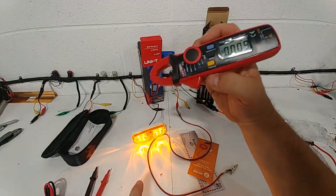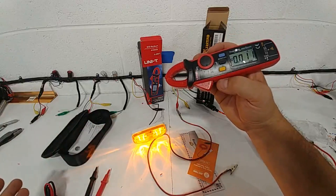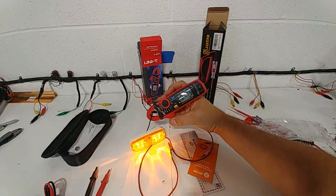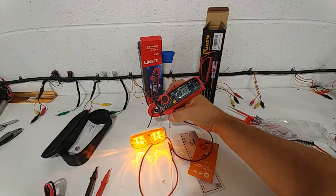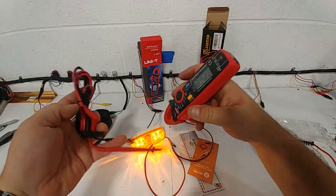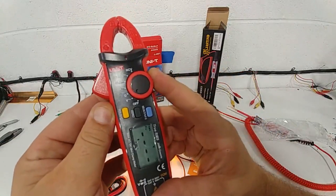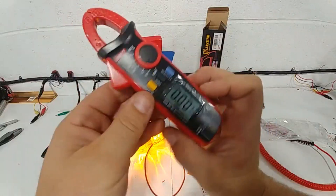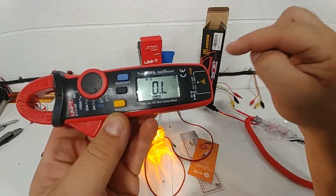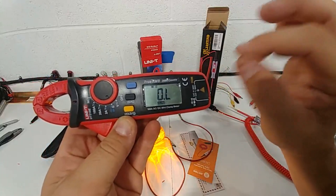Very, very useful to know what size fuse to put on your 1, 2, or 20 LEDs — what do I fuse my main wire on? Well, set your system up and check your draw. We're at 0.11. I would say that this light, if it was alone, would need a 2 amp fuse and that would be more than enough. Now this also comes with wires that plug in down here, which turns it into a volt-ohm meter as well. You can do voltage — it'll check AC voltage or DC voltage. You can also check ohms of resistance to see if there's continuity between a wire. I don't use it very often but once in a while it's great to have.